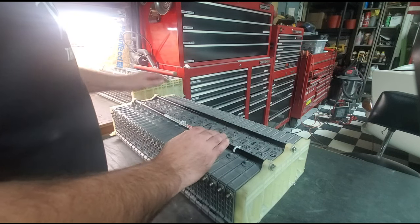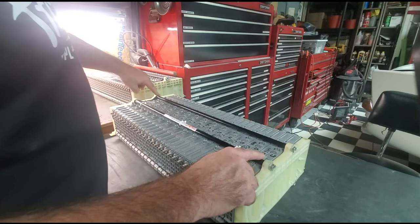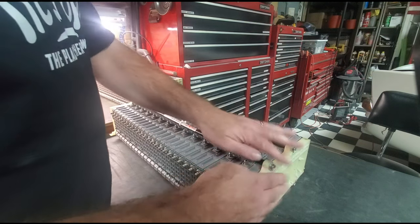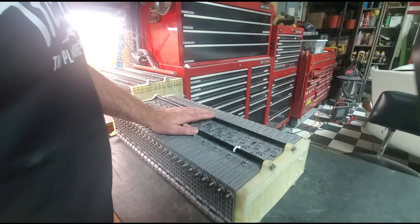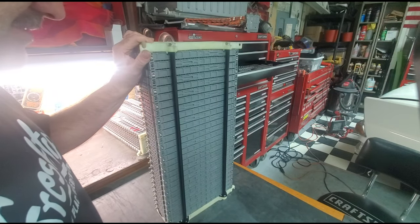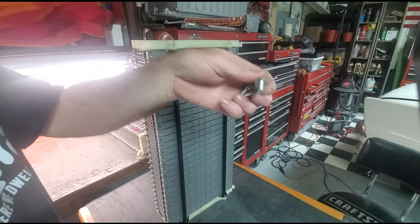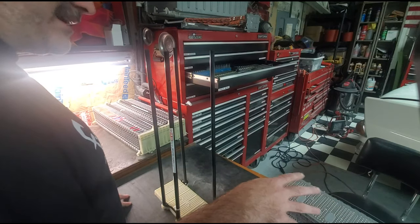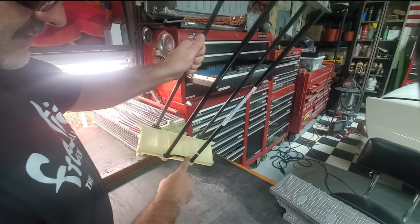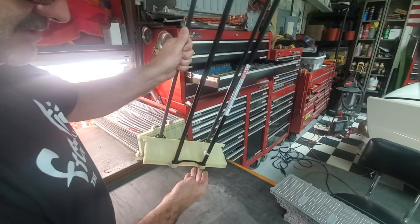When you have your batteries in hand, this is the next step. We'll look at these black bars — one end has a solid black piece of metal that runs across. The opposite end is the one we want to take off, which will allow us to slide all these batteries out. The easiest way is to turn the battery pack up on its end and take all four screws out. I've got my batteries separated into a bad pile and a good pile — you can see the metal bar in there. The reason you take the cap off the other end is because you can't get the batteries past this metal bar.